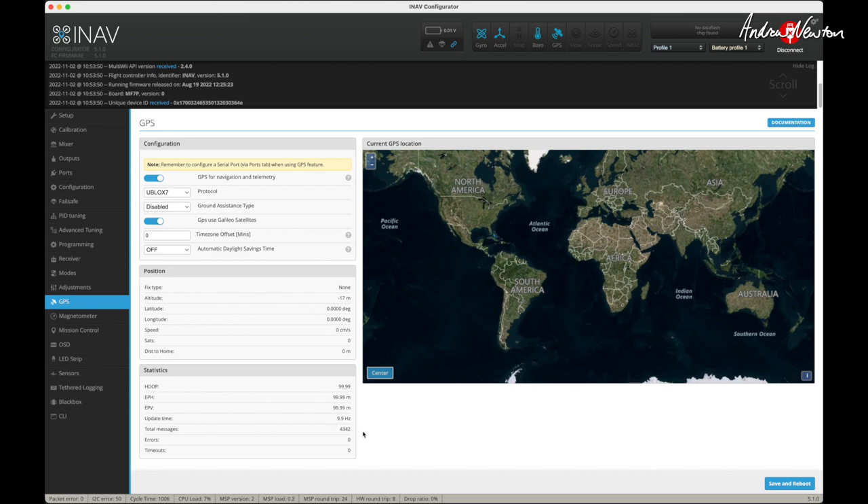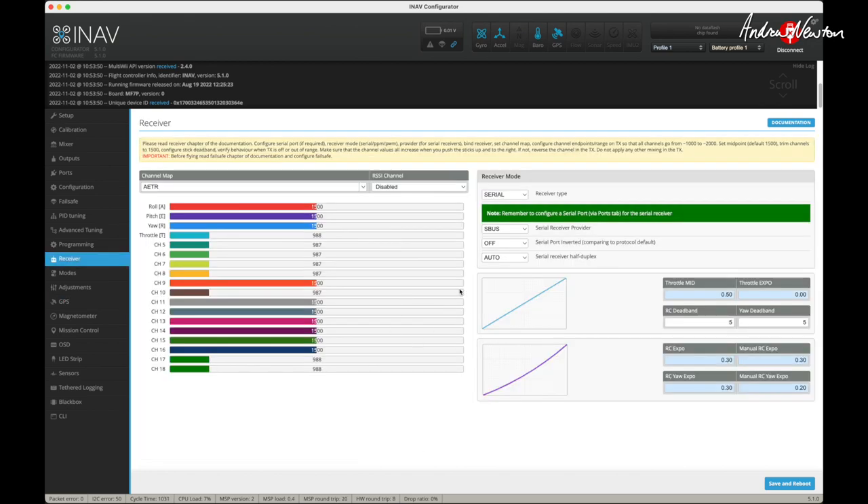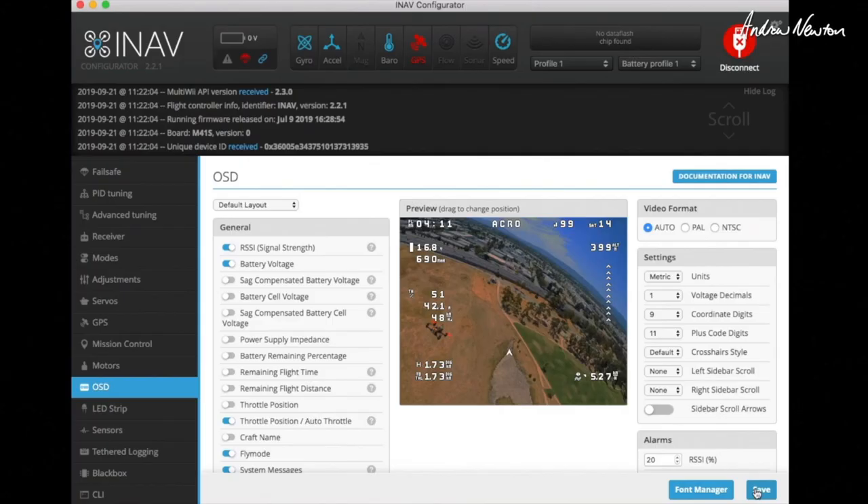On the GPS tab, make sure 'Use GPS for navigation and telemetry' is selected. Before that, make sure you've set up the GPS on a port and plugged it in — check that the total messages counter is counting up, which confirms your GPS is working. It may not have found any satellites if you're inside, but if that counter is incrementing and you've got the blue GPS symbol, you're good to go. Just wait for the sensor to acquire satellites — plug the GPS or flight control board's SmartPort into the SmartPort cable on the GR8, discover sensors, and choose what to display. Thanks for watching.